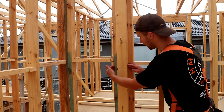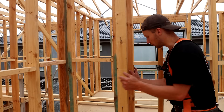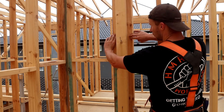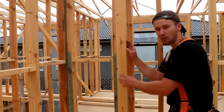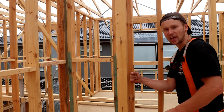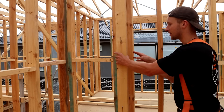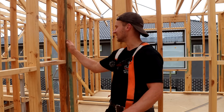On the other side we can see that first junction with the 90mm gap — that gap is for where the stud intersects with the wall next to it. Those blocks serve two purposes. First, they're a good spacer so a stud on either side can be installed, and when we hang a sheet of plaster we've got a stud on both corners to screw our plaster sheet into. Second, when we start straightening our walls these studs could have a little bit of bow — it's impossible to get a planer in that junction — so we can push this in or out to get it straight and then shoot it into those blocks to hold the studs perfectly straight. Always make sure you put your straight studs in where your junctions are going to be.